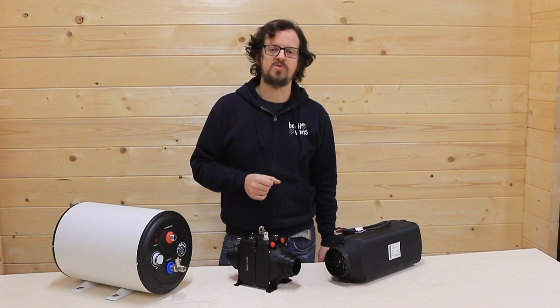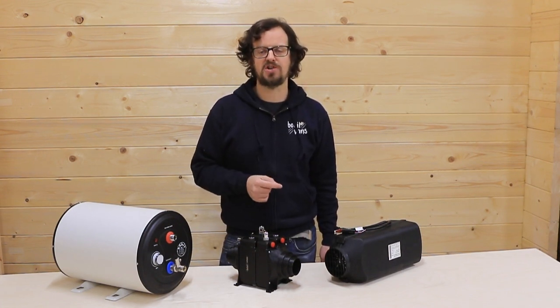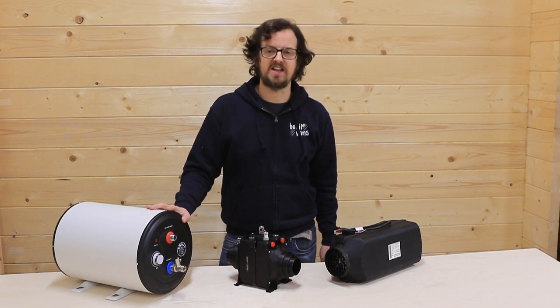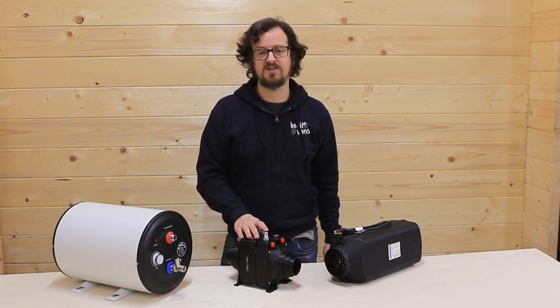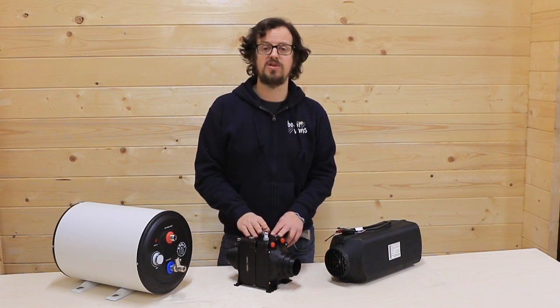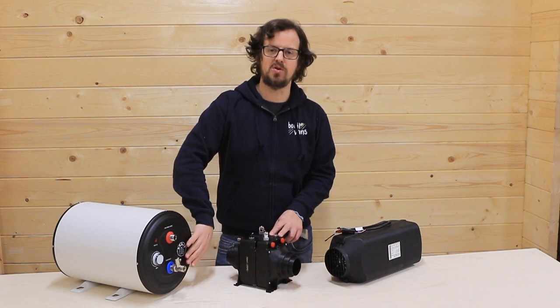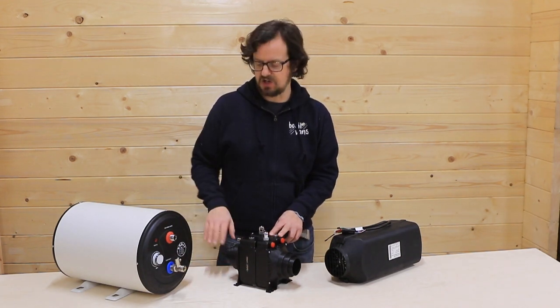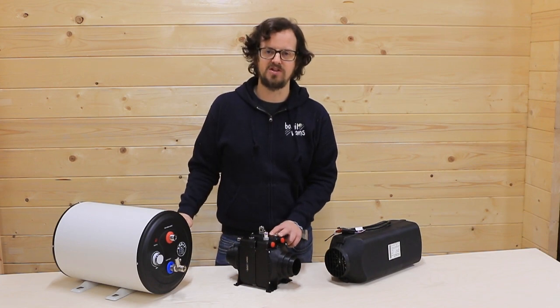If you use the Bobble Air Hybrid with a 4 or 5kw heater, you can get 30 litres of hot shower water from this 10 litre tank. The reason is that as cold water enters the system, it firstly goes through the heat exchangers — so by the time it reaches the tank it's already been preheated, and you don't have cold water entering the tank and cooling down the hot water inside.